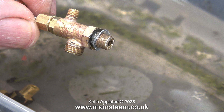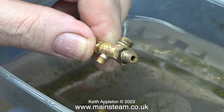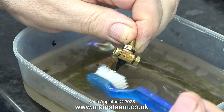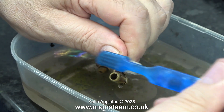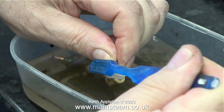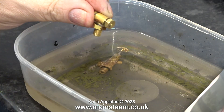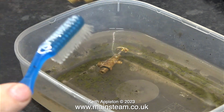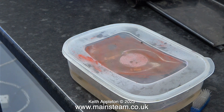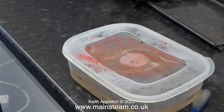You will notice that the bottom water gauge fitting has an aluminium washer fitted. This was removed and now it looks like this, and when I fit the water gauge to the boiler I will use copper shim washers to align it. In this clip you can see that the paint is literally falling off the parts, and I'm not applying much pressure with the toothbrush to remove all of it. Once I take these parts out of the cellulose thinners and the solvent has evaporated, I will take them up to the main workshop and polish them.